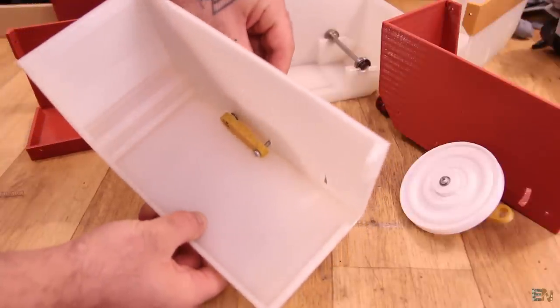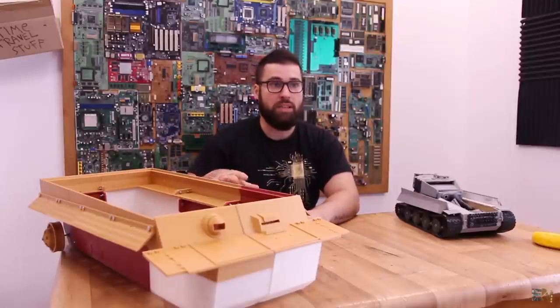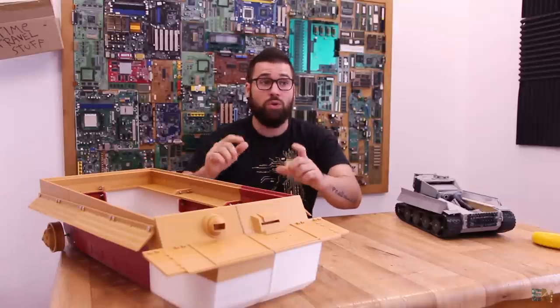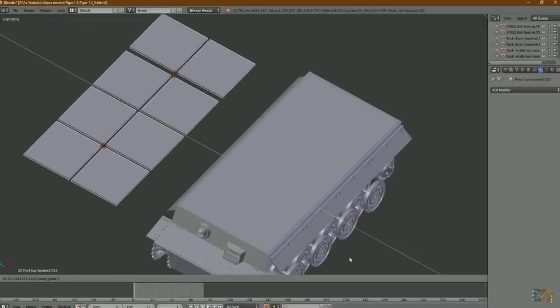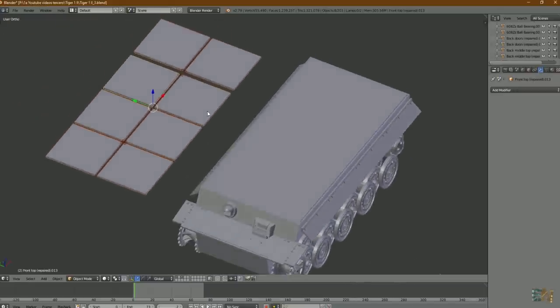And of course, I will paint it all because as you can see right now it's made out of different colors. Everything will be 3D printed except this plate here which is made out of wood. But if you want, I will also share the plate files so you can 3D print those, though you'd have to divide it into 6 or 8 parts because otherwise it's too big to fit on the printer plate, which is usually 300x300mm.